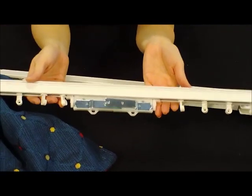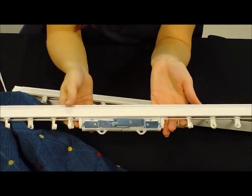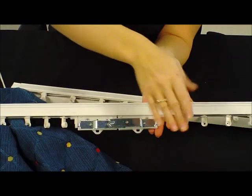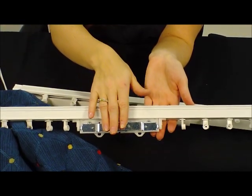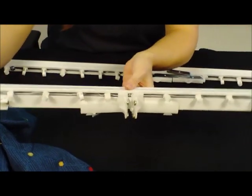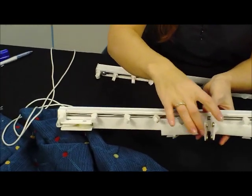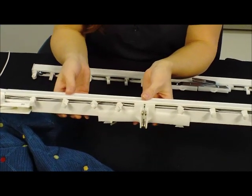The overlap master is great for light control — it's going to completely seal up any light gap that may happen when the drapery comes together. The disadvantage of the overlap master is that you will have a depression; you won't have a nice continuous rolling fold throughout the body of the treatment when the draperies are in the closed position. With the butt master, you would have complete continuity in the beautiful folds and rolls across the entire drapery. However, depending on your fabric and the treatment, you may get a slight gap depending on the thickness of your fabric.